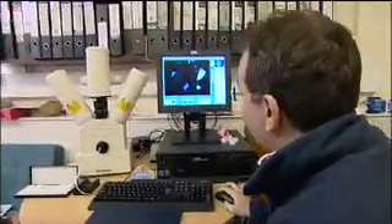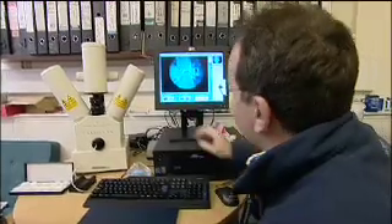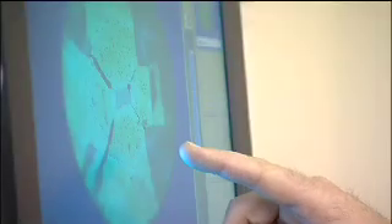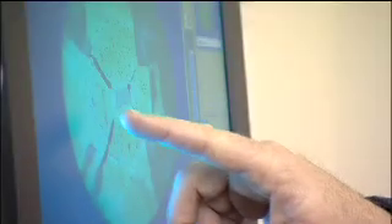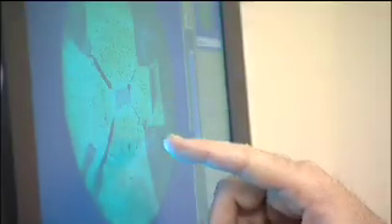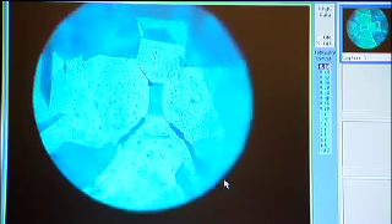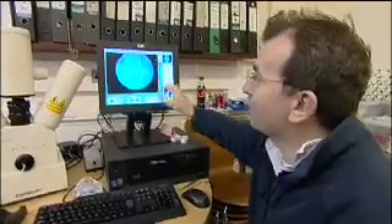You can switch on the ultraviolet lamp to excite the diamond and just bring it into focus. It's a bit dirty because I used my fingers, so you can see all the spots of dirt on the surface. But what you can clearly see are these different growth sectors coming out, and this is called cubo-octahedral growth which doesn't occur in nature. The seed will have been down here and the diamond actually physically grew out in a matter of a couple of days from that seed. That pattern straight away tells anybody that that is a synthetic diamond.